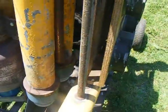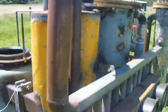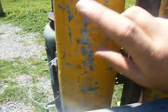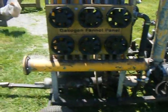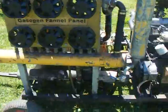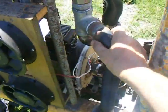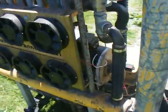The gas enters that tube and discharges quite a lot of moisture there, so cooling is also taking place. Generally when I open the cyclone I get a lot of dust, and when I open the precipitation pipe I get a lot of water. The gas then goes into a fairly large radiator with electric fans running on 12 volts from the car battery. By the time it's passed through, the gas is at room temperature — I can put my hand on it and it feels as cold as any other part of the system.